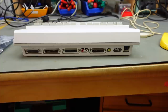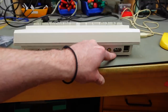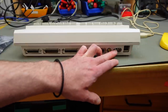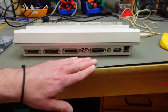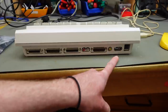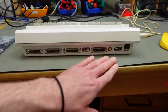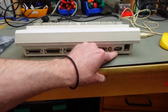In order to have an HDMI socket in the rear part of the A600, we are going to remove the RF modulator. Both the Amiga 600 and the Amiga 1200 came with RF modulators on board — probably to be able to hook them up like a gaming console to a TV. But of course they have the RGB out, and for modern times native HDMI output is really handy. So we're removing the old school way of hooking this up and putting the modern way in. We have to open this up and desolder the whole RF modulator — that's going to be the most difficult step. The other stuff should pretty much be plug and play.